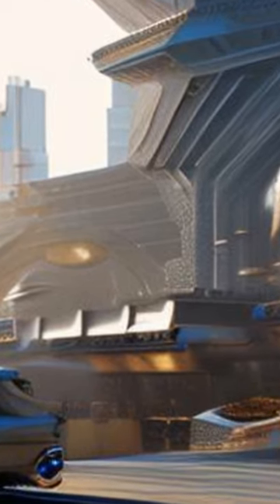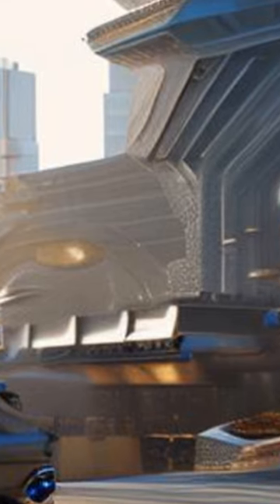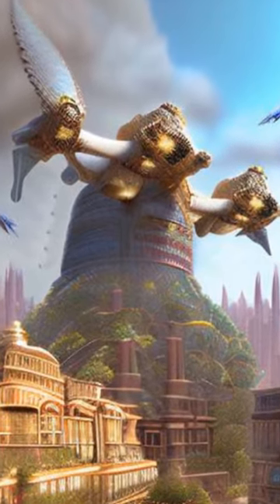It found that the alloy consisted of two distinct phases: one consisting of cuboidal nanoprecipitates aligned in rows along less than 100 type directions, and another consisting of channels between these precipitates. These phases were both coherent and had the same crystallographic orientation within the former grains.